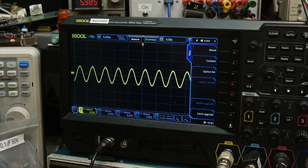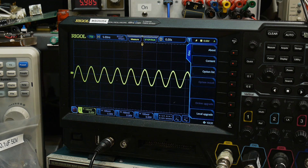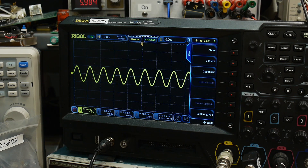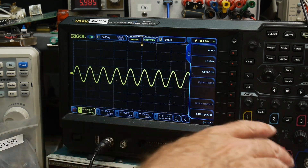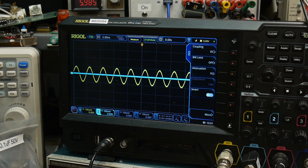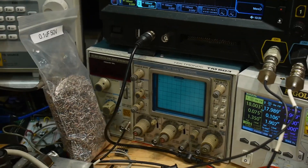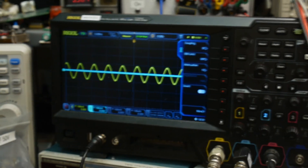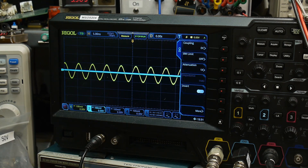So this is the output of the mixer. This is the signal, and it is 0.2 volts peak-to-peak. Let me turn on channel two, which is the other pickup — that coil pickup. It's supposed to output 0.2 volts peak-to-peak, which is what channel one is. But we're getting nothing on the other connector. This is the one that's good, and this is the one that's bad — there's nothing coming out on that one. So something is obviously amiss there.